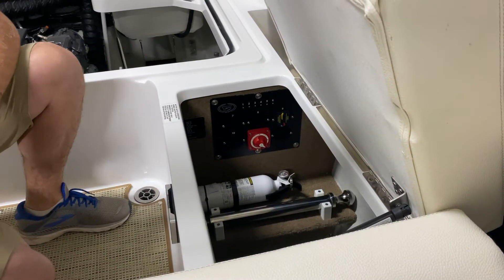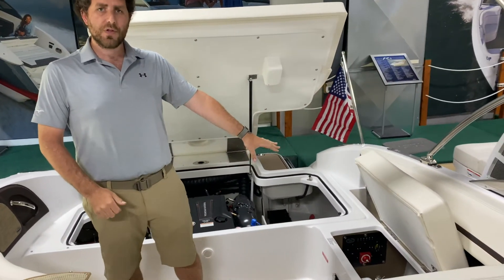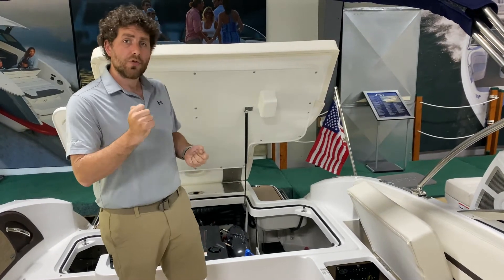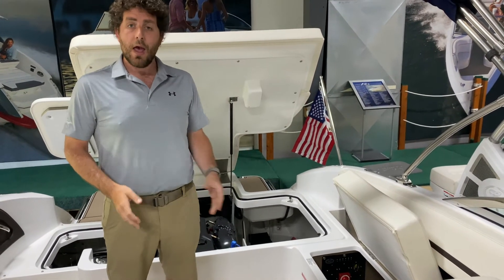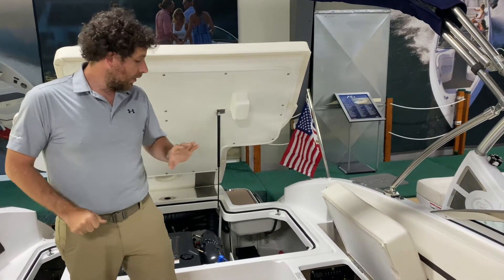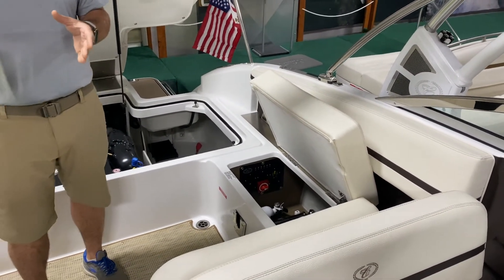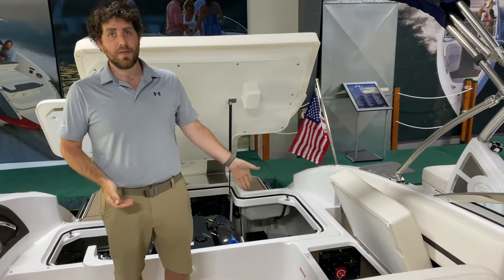In the Cobalt, it's about five o'clock on this switch, and other systems are similar. After the switch has been hit into the combined position, you will come up to the dashboard and start your boat. After the boat is running, you should actually drive the boat for 20 minutes with the battery switch in the combined position. After that, bring your boat to a stop, but keep it running — don't shut it off. Come back here to the battery system and return your switch to the on position. By doing so, your battery system will then divert 100% of the charge to the battery that needs it the most, which in this case would be the dead battery.